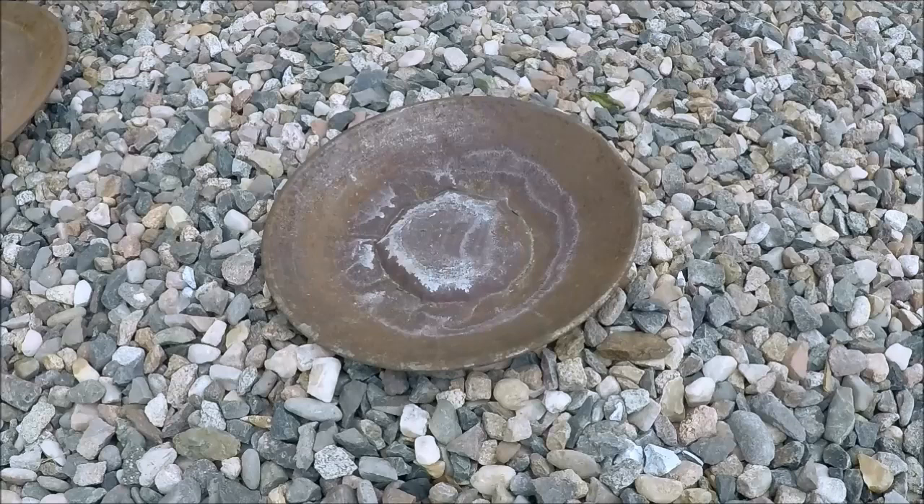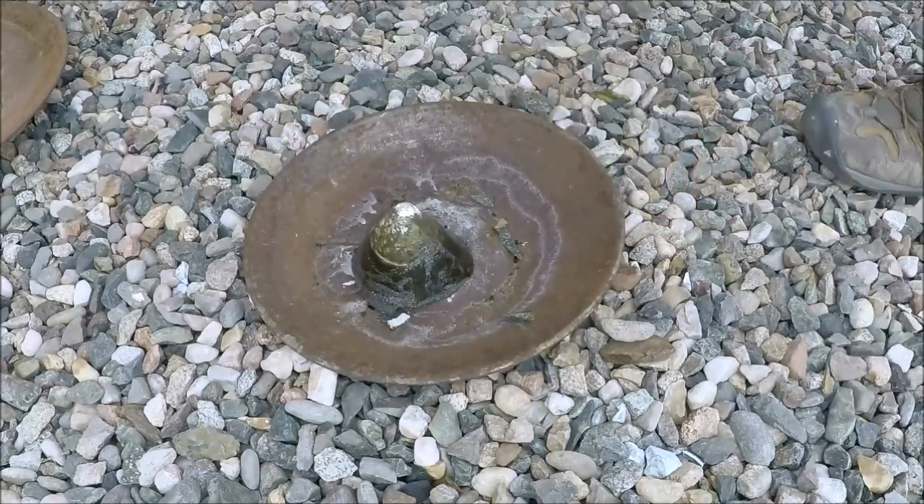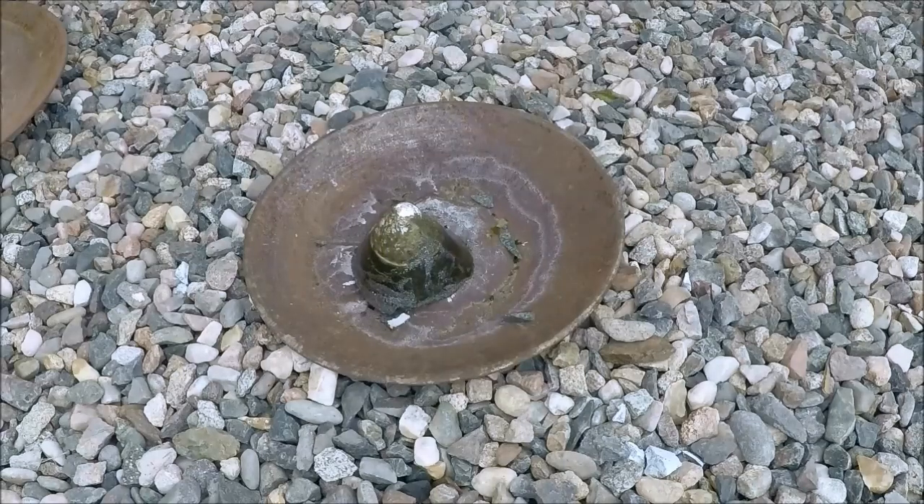Okay, I'm back. I think that's cooled off enough. I'll put my gloves on here and I'll get that mold, dump that mold over. That's a pretty good sized mold - it's six inches deep and eight inches across. The big old cast iron thing weighs quite a bit. I'll dump this over. Yeah! There it is. Sitting on top of there is about 600 grams of silver, something like that. I'm only melting a little over a kilo at a time - that's all I can get in my crucible.